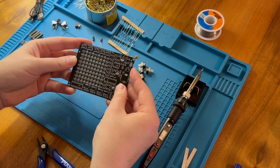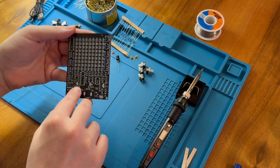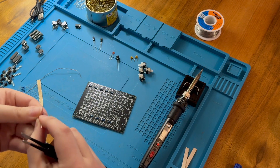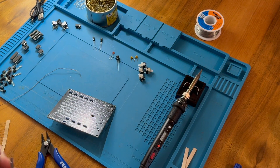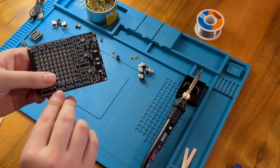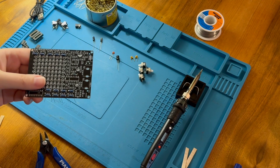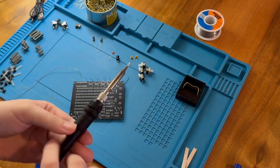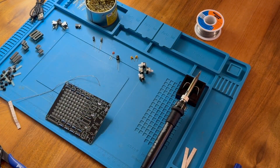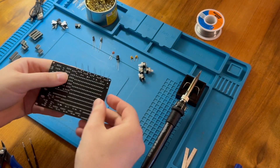I'm trying to put all of the tolerance bands towards the bottom of the board — in this orientation towards the bottom on these resistors, or to the right for any horizontal ones. These resistors are quite tightly packed on the board, so I'm just bending them quite tightly with the tweezers. These 10K resistors have brown on both ends — it's brown, black, black, red, and a brown tolerance band — which is why I put them around this way to match the direction I've just described. I'm just using BluTac to keep the resistors in place and making sure they're snug to the board.